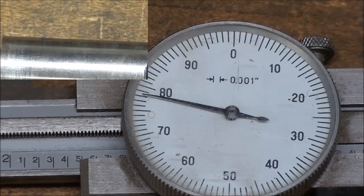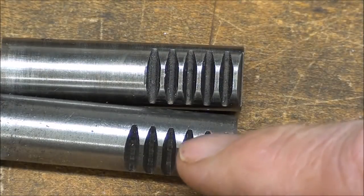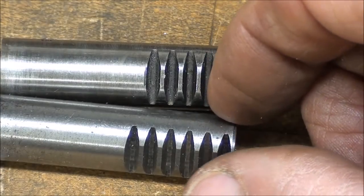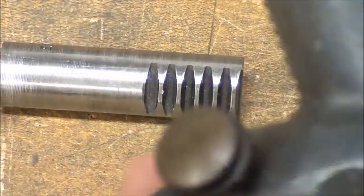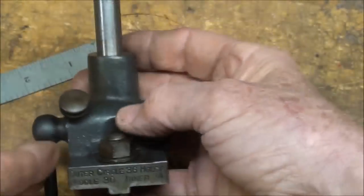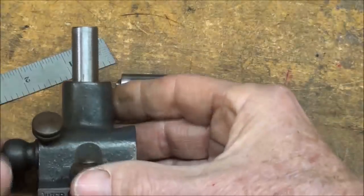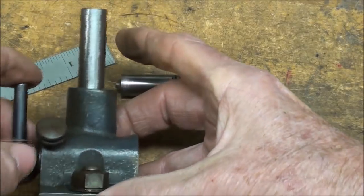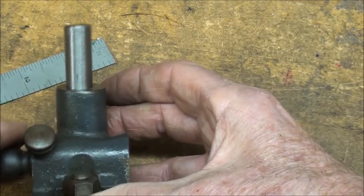Back to the business at hand. Okay, it's looking mighty good. There's the original. A few more tool marks on mine than there is on the original, but no problem. And I still have to cut this to length, but let's put it in the fixture here now. I did deburr it - there were not a lot of burrs on it. But when we put it into the actual part here, you can see it's going to work just fine. There's a relatively short stroke here, of approximately a half inch, and that's all that's needed.